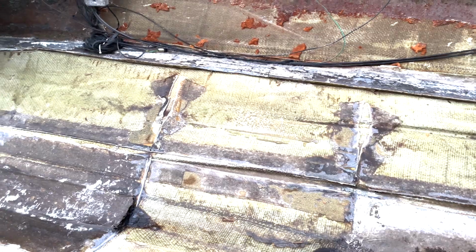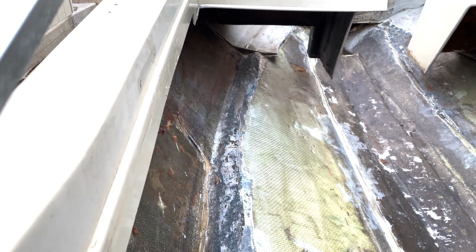This outer edge, as you can see here, is probably the thickest in terms of fiberglass that I've dealt with in the entire demo process of this boat. You can still see the lip over there, and then I've kind of started grinding on it. I was using the oscillating blade to slide under there and cut it off flush, but I end up going through probably a blade every 2 or 3 inches, whereas my grinding wheel seems to do really well.